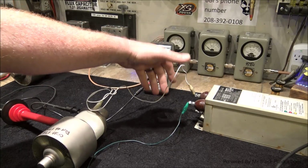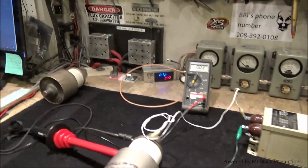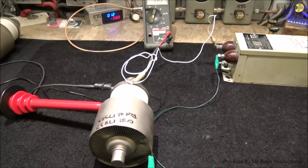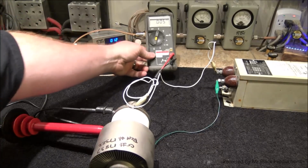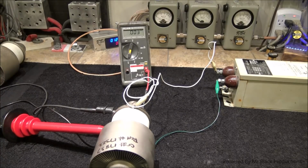Our space is really important to us here because that is what our insulating factor is. Okay, so right now we've got our probe touching the anode. We're clipped to the cathode, or your grids, in this particular application. And we're set at 10 to 1. Now we're going to start pouring on the gas here. We're going to bring the high voltage on. We're going to see if it has an internal short underneath high volt operation, because we've already seen it doesn't underneath a low voltage operation.